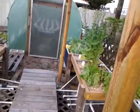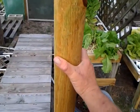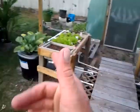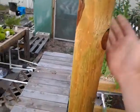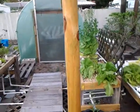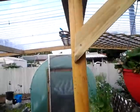What we did is we started with our main two posts and figured out where we wanted to put those. We wanted our main post right here because it would be perfect going over the pond — we have stuff off to this side and stuff off to this side. We put our first post exactly where we wanted it, used a two-foot level, leveled it up, and made sure it was nice and straight.